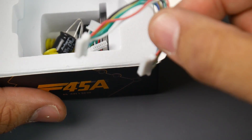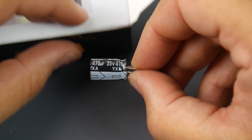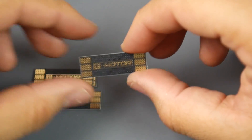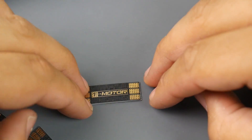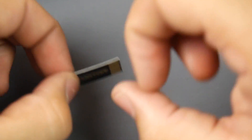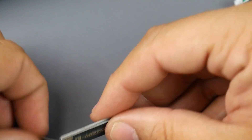Let's see what comes in the box. We have a connector — I'm guessing they'll be releasing some sort of flight controller. They give you two connectors, two low ESR capacitors — Rubycon 35 volt 470 microfarad low ESR capacitors — rubber grommets, and T-Motor branded race wire. These are really nice because you can make your motor wires really short, solder them, and bring the wires up to the 4-in-1 ESC, so if your motor gets hit you don't damage the ESC wires. I didn't see this in the F55 amp version, that is a huge plus. Good job T-Motor.